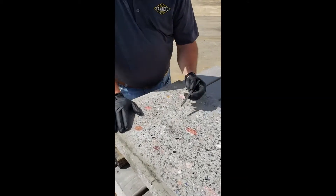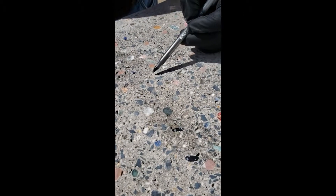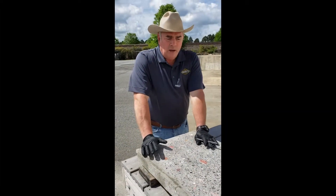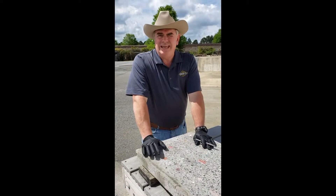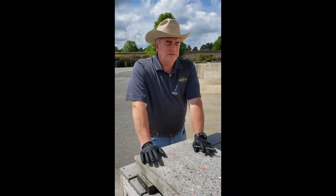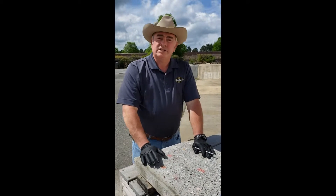Let's look at some voids. What I'm discussing is these holes — they go from very tiny to actually larger holes that I can fit a pin in. All of those voids are of concern if we're going to use this for any food preparation, or even a piece of furniture, because voids allow germs to stay in the surface. It's very similar to the fault process behind a granite top kitchen — the same faults. We need to seal the pores before we actually seal the end product.